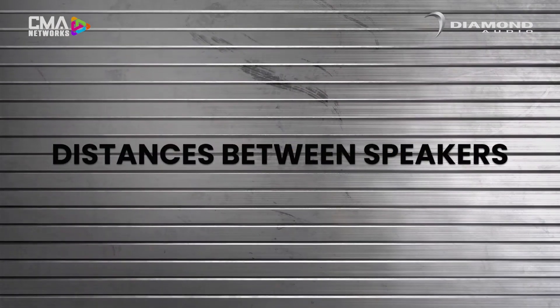Another reason you want to use DSP is because of the differences in speaker distances. Like in a car the speakers may not be symmetrical, but in a boat it's even more so — most applications the speakers are not in a symmetrical path, so you have lots of opportunity for cancellation. What happens is the customer or end user is going to turn that volume up to try to compensate for that, so we're overdriving the speakers and using more power. Utilizing the DSP time correction settings, we can optimize those speaker distances so everything is technically at an equal length, so we're not having cancellations and we're getting the most efficiency out of the system — and it's going to sound better on top of all that.